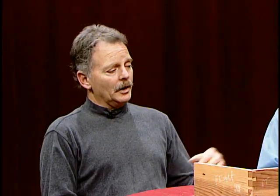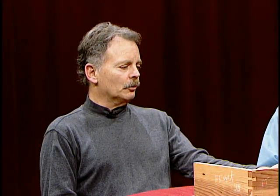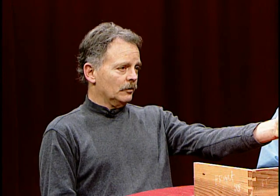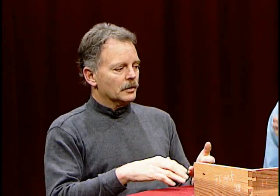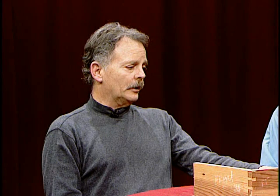Well, absolutely. I think most people don't even understand the principle behind plywood and why it's so stable. Plywood is basically stacks of veneer, where they take each layer and lay them crossband to each other as they stack it. So they interlock and cancel out the expansion and contraction, because they're working against and for each other. That's the dimensional stability of plywood. And so there's absolutely nothing wrong with plywood. It's just that it's not solid wood.